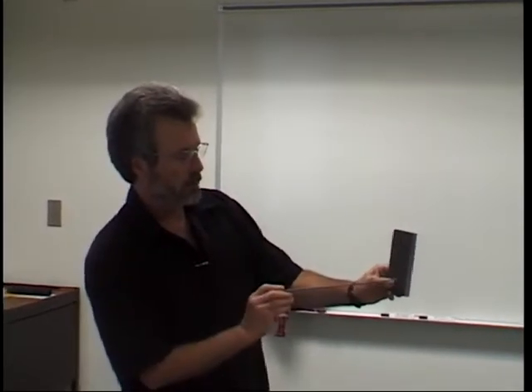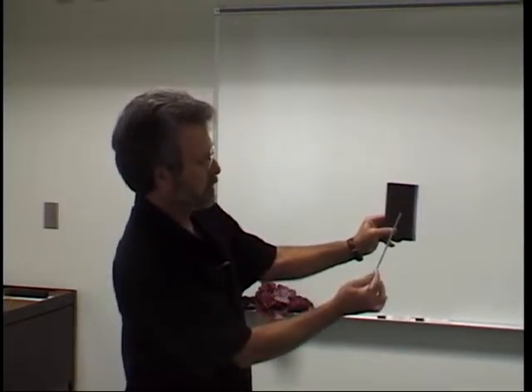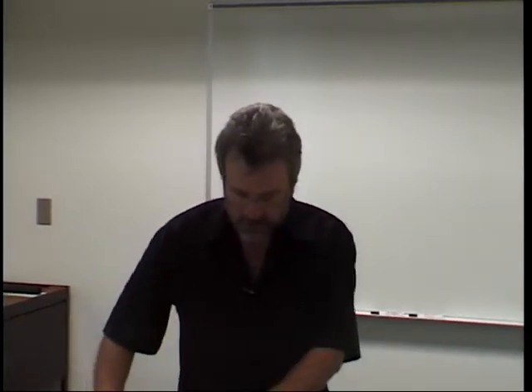In relationship to the plate, you want to make sure that it's at 90 degrees. So we have a 10 or 15 degree down angle, but 90 degrees transverse to it. Then it says the basic welding motions used in vertical welding when you're traveling up are shown in figure 1369 — those are the ones that we just talked about. Figure 1370 illustrates the actual welding position.